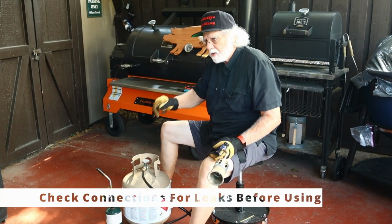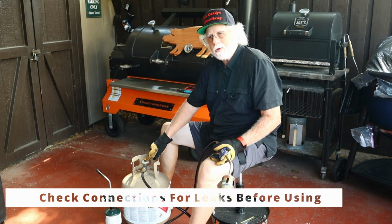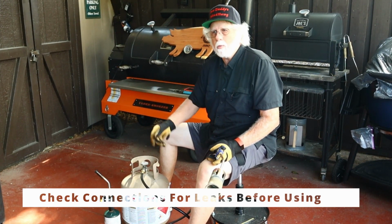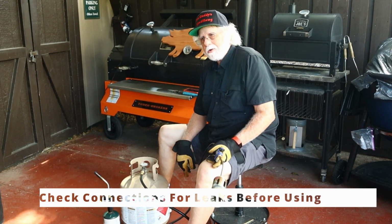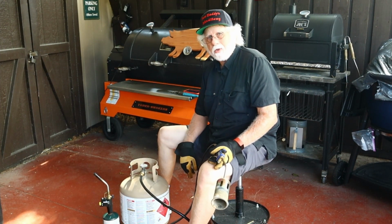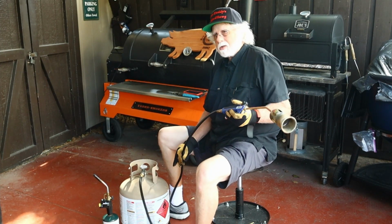On these propane tanks, technically, this valve is a double seating valve. So it's fully seated when it's closed or when it's wide open. So that's the position you're supposed to use it. But I can't make myself go wide open with it while I'm using it, even though it's got the excess flow device on there. And the excess flow is a check valve.